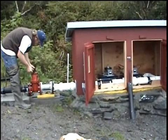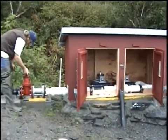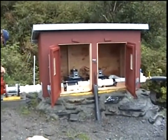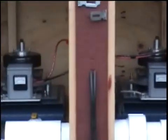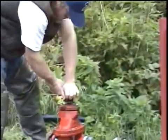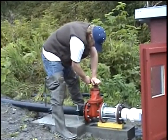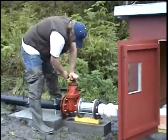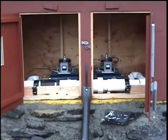The first time we opened this valve to start the thing, we didn't have the power breaker out of it on, and the units spun up like a jet airplane — sounded like they were going to fly apart. We want to open that valve really slowly so that we don't put a water hammer on the piping. You can hear it coming on slow. We should end up with about 55 pounds of pressure when it's running and generating about 17 amps.